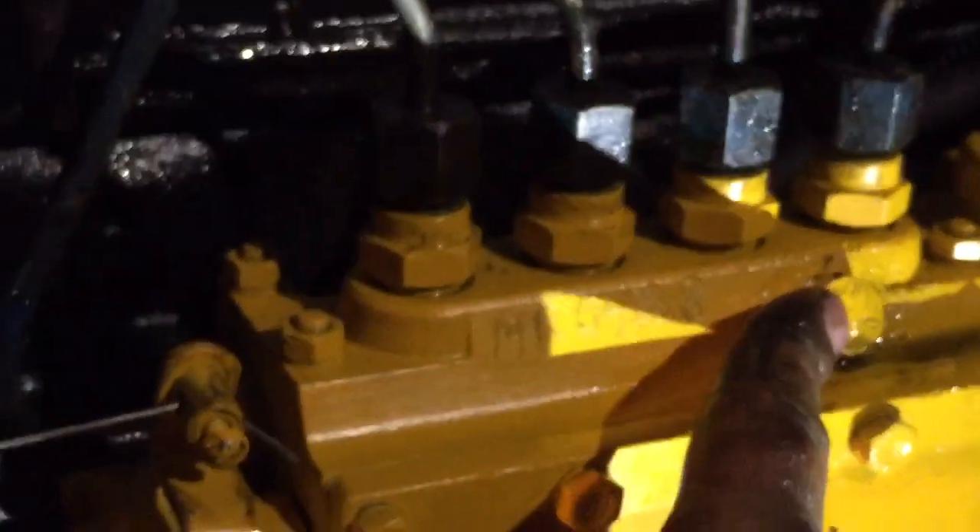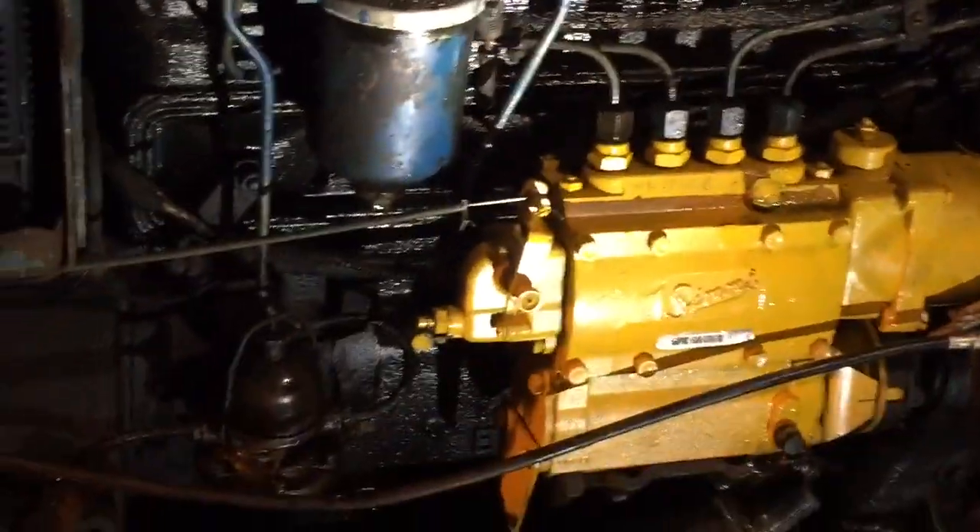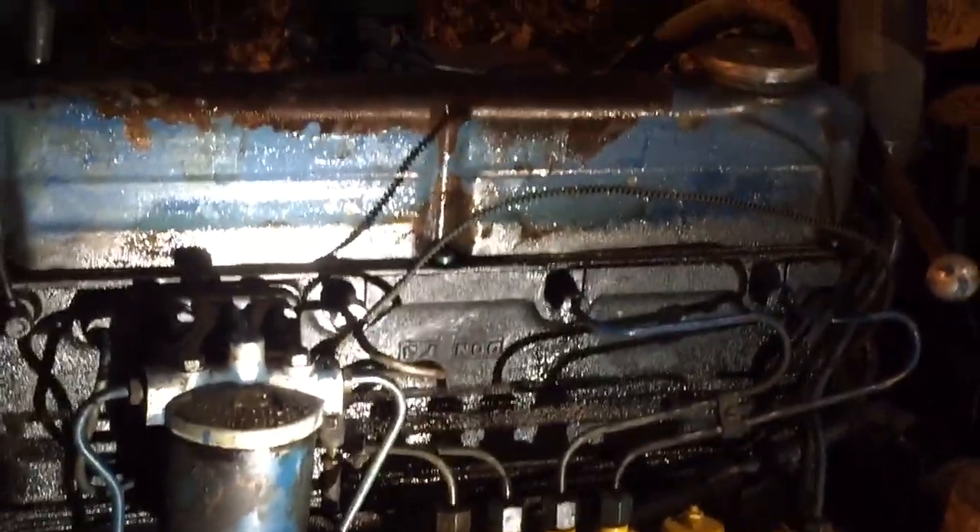Back to what I was saying — your air is going to go up. So from the fuel bowl here, you go up, and in this tractor here's your fuel filter, fuel in, fuel out. You crack both of these — these are air bleeders. Once all the air bubbles stop coming out this side, close this. I have a pump lever here, so I'm pumping fuel as I'm doing that. Once my air bubbles stop on this side, I close this side, and then repeat the process until air bubbles stop coming out here. The air goes through this, down into the pump, so I need to open this, and repeat until air bubbles stop coming out. Once air bubbles stop coming out here, I close that, crack all the injector lines, and crank the engine until air stops coming out the injector lines. Once that's all squared away, you should be good to go. And that's about all there is to it. I'm going to play around with this a little bit and see if I can get her hitting on all four.